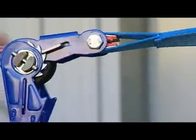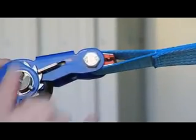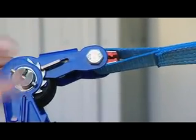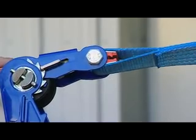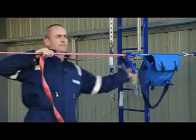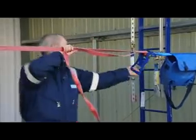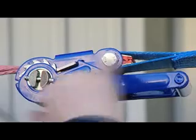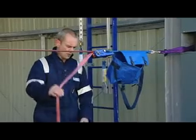What you're looking for is just behind the back of the ratchet there's a tension force indicator — you'll see a tooth sticking out and a semicircle. As long as you've got that tooth level with the line or inside that semicircle, the tension is correct. As you can see, it's just gone inside the semicircle.